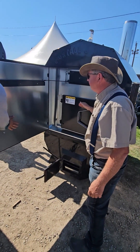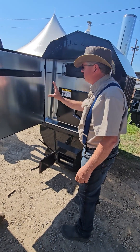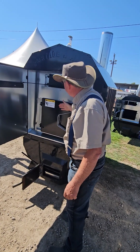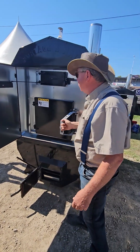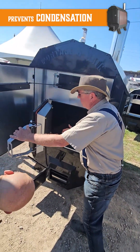There's a bit of styrofoam in there. It's not going to be hot there, but it prevents condensation — when you're cold on this side and hot on the other side, you have the risk of condensation. So we prevent that condensation for all of them.